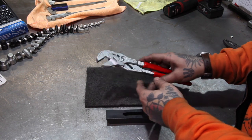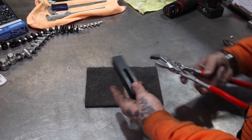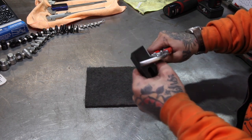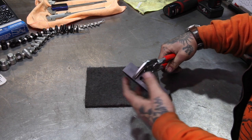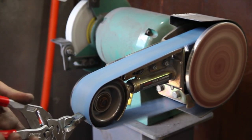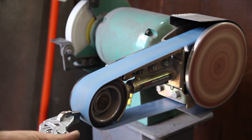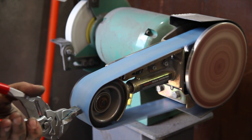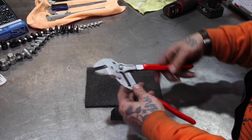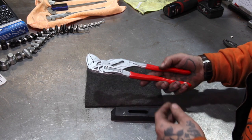The huge bonus with the parallel pliers is that they have a lot of surface area that you're actually grabbing onto and completely smooth — no serrations. So when you're grabbing onto something, you can really hang on to it with that nice long jaw. If you're at the belt sander or bench grinder trying to make a little radius on the corners or something like that, you don't have to hang on to a shorter piece with your bare hand. You're not going to get your fingers burnt. I use them a lot for hot stuff, whether it's just been heated up on the oxyacetylene, and I need to move it from one place to another. You can grab quite thin stuff all the way up to two inch and get it into some water if you need to quench it.